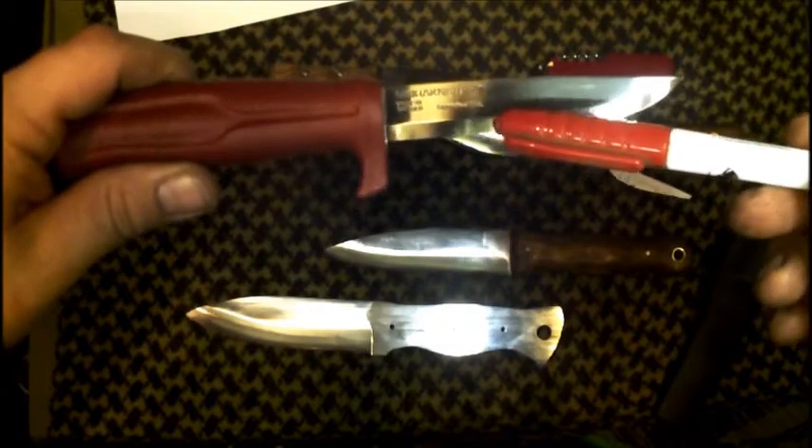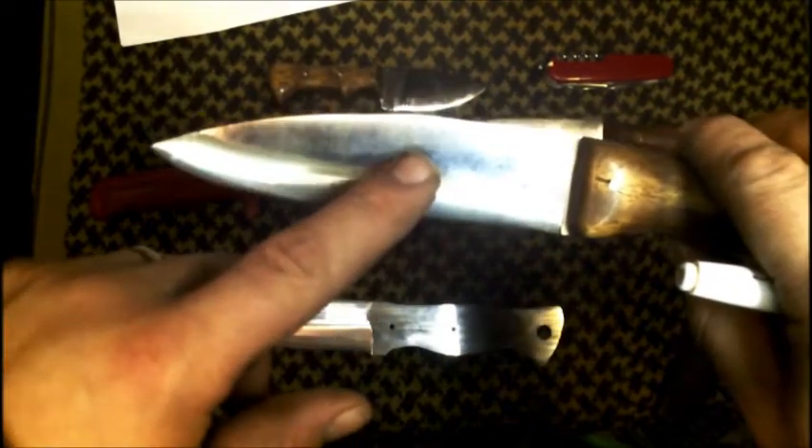What I'm trying to do is convex, but I had some feedback on one of my blades. If you have a look at this one here, the actual convex shape only starts just under halfway from the top to the bottom. It's a bit light on the subject. The feedback I got from Kylie was that I need to lean it out — so here's my next generation, and you can see that is over halfway.